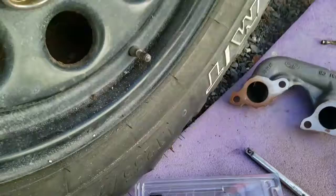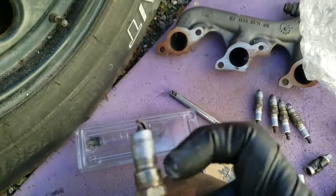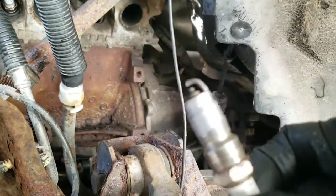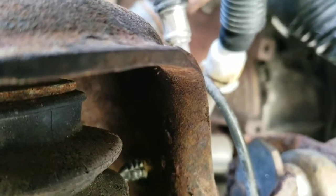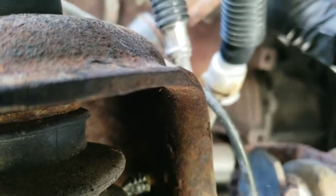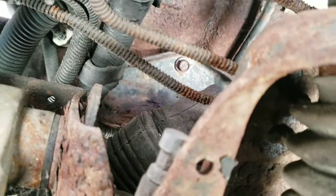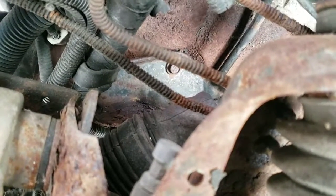Let's get these manifolds on. On the F-150, you want to put Loctite on the plugs — the blue one, the one that stays soft. On the Ranger, or any other car that has aluminum heads, you want to put anti-seize so they don't lock in there. When you go to take them out, they come right out. Let me get these in here and throw the manifolds on — clean up the area there.